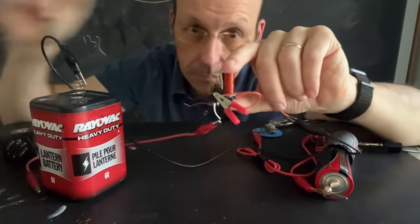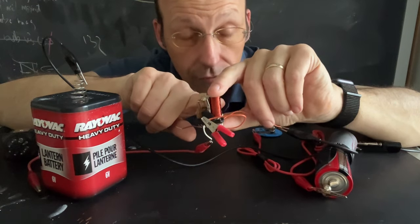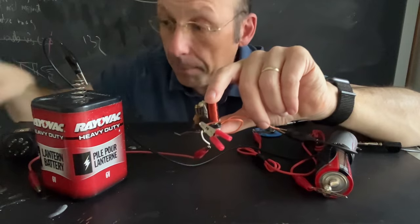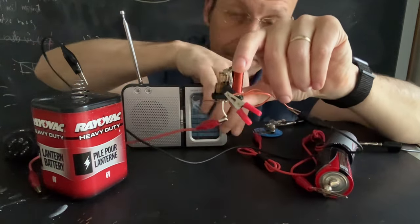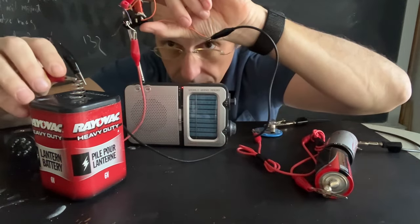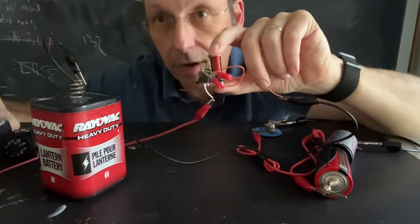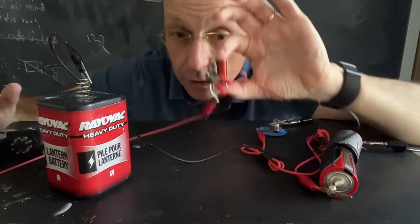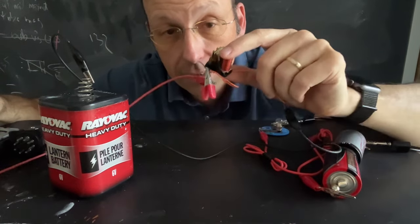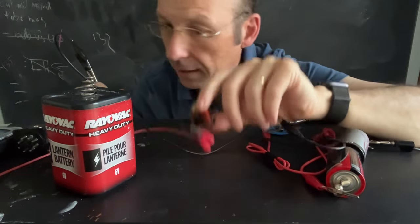But that's not the cool part. The coil of wire — the electromagnet — acts as an inductor. And when you have a changing current in an inductor, it produces a large voltage. When you have a large voltage, you get a spark. And the spark produces electromagnetic radiation that can be detected by a radio. I have my radio on. This is what's called a spark gap generator — it's not a great one, but it's producing sparks because the coil is turning on and off. Those sparks produce electromagnetic waves, and those waves are detected by this AM radio. So I think that's pretty cool — with this simple little relay, you can turn it into a radio in this way. Not a very good radio, but it is a radio. So I hope you like that. It's kind of fun to play with.